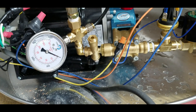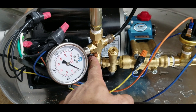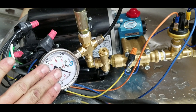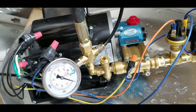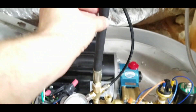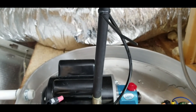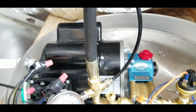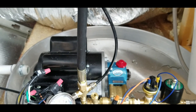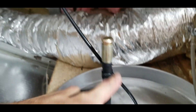The reason for that is you want the regulator to not be fully seated — you want it floating a little bit so it can react quickly to pressure spikes. From there I put in a cross T and I have my pressure gauge so I can read out how much pressure I'm pushing. Then I have a surge tube — it's kind of rubbery, made to expand, which stops the vibrations a little bit. It fills up with air so the air compresses with each stroke of the pump. From there it goes to feed the actual misters.